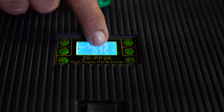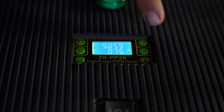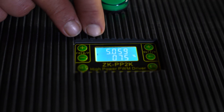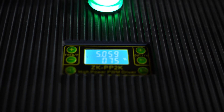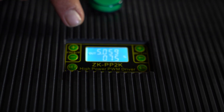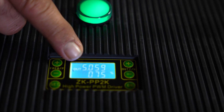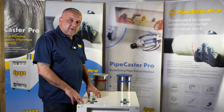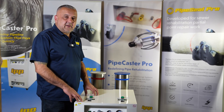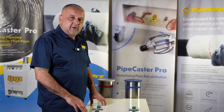To adjust one ounce up or down it's one whole number either up or down. Adjust these numbers on top with these buttons. Leave the 75% setting alone. Sometimes the off button gets accidentally pushed on this side — you'll see it says 'output not.' If that shows and you turn the pump on, nothing is spinning because there is no output. Turn off the pump, go up to this switch, turn it on — now it says 'out' and your pump turns on. You have to have output. This machine runs on a 12 gauge power cord — do not use anything else. It also cannot run on a GFI plug — you need at least a 15 amp plug. If you have a generator, anything over 3500 watts will run this machine.